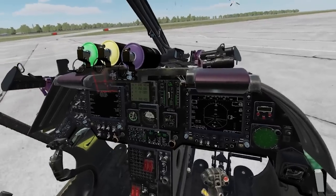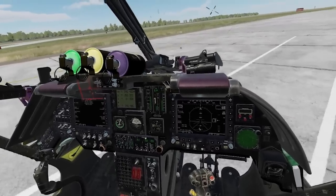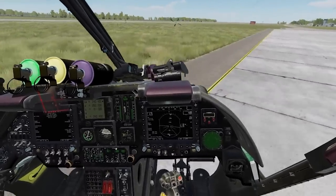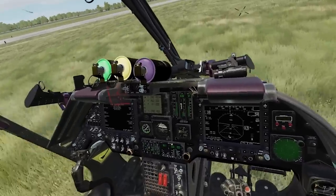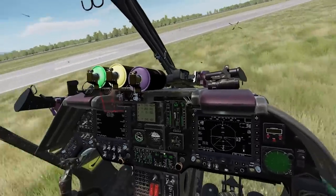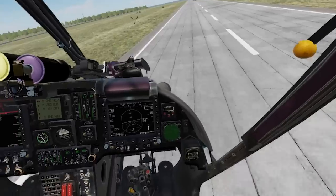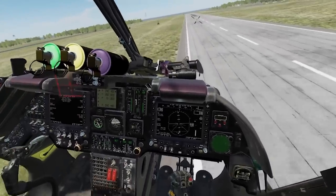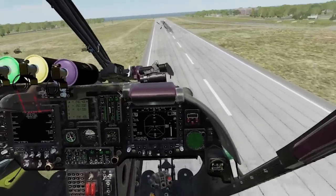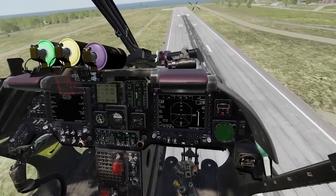Looking for a small drop in radar altitude as I transition forward — we went to about one foot. I still have not touched my collective; my hand is in my lap. Torque dropped off a little — we're approaching ETL. Watch my control indicator as I push through ETL: I'm getting that blowback and right-roll effect from transverse flow. Transitioning forward, getting more efficient, upper range of ETL. Controls have transitioned forward and left. Everything's stabilizing in forward flight, well past the ETL range. Torque fell off about four to five percent — still haven't touched the collective.